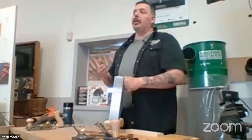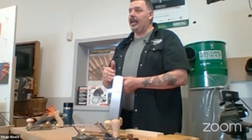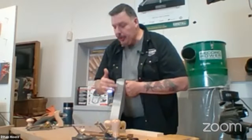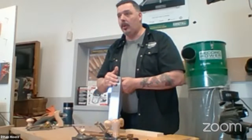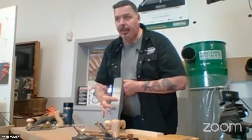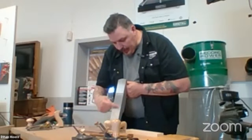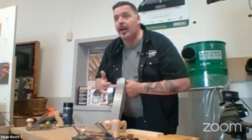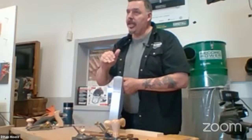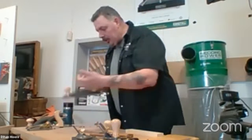Before MTC came out, the best option was to find a Stanley plane that was in good shape. Then you would have to know how to flatten the sole, which is no easy task. If you ended up with a hollow anywhere around the mouth, you're dead meat. You can have a hollow at the toe and heel, but you cannot have one anywhere around the mouth — because then the blade has to stick out further, and it's not going to work the way you want.